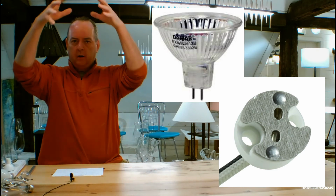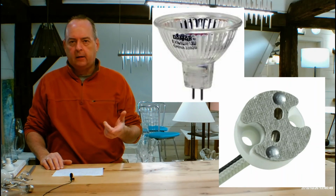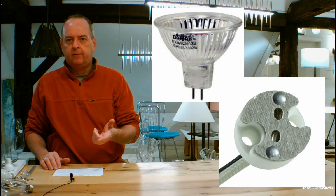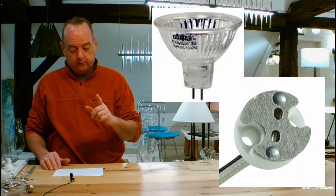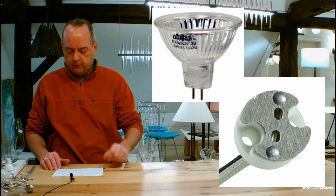So it's going to just pump a lot of light down. It makes pretty good task lighting. If you're going to be doing a halogen, well, you have to do a halogen. So the halogen is going to be capping you at 50 watts, and that throws a tremendous amount of lumens. And you can put this on a dimmer, so make sure you do that too.